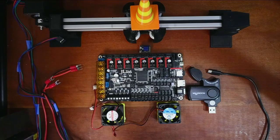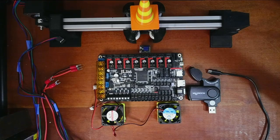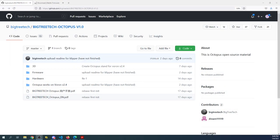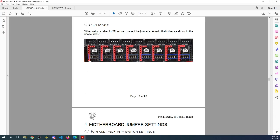In order to do that we have to look it up in the manual. Inside the BigTreeTech GitHub website you can see there's an Octopus version you can search on. I recommend downloading it because viewing it doesn't work very well at the moment. I pulled it down and as you can see in the upper corner, this is the enable pin we have to find — and these are the actual jumper settings.